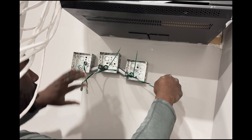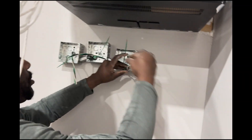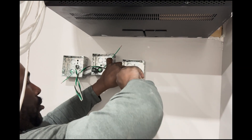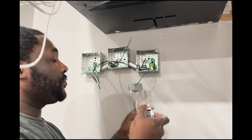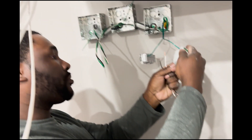Now I'm sending another piece of wire on the other side so I can link all the outlets. In the first box I'm going to take this ground with the ground going into the box and splice it — I'm going to create two tails because I'm adding a quad outlet on each box.